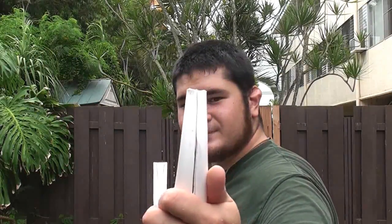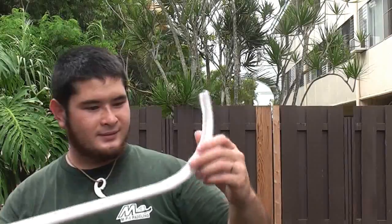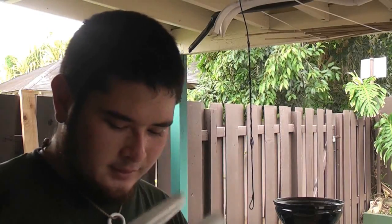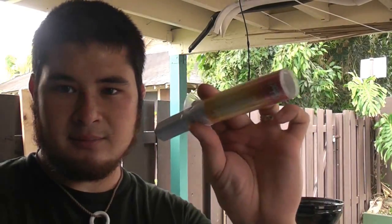You can see that. Let's go put that together. You can use just about any glue — you can use PVC cement. If you are going to use PVC cement for this, you should get at least medium bodied but preferably heavy bodied PVC cement because you are going to need it to fill some gaps. This is not going to be perfect. What I am going to be using today is some epoxy putty.